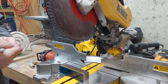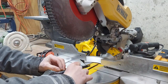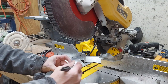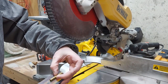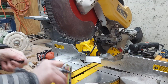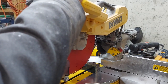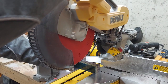For this step I'm going to use my big DeWalt chop saw because the block's so big and I think it's safer. I could also do this by hand but we'll use the chop saw. I want to mark extra meat on both ends because this will be dressed down on the disc grinder right next door — you want some room to work in case you blow out a little bit or mess up the ends. I'm going to do one cut at a time because of the kerf, and I actually sight down on my right side — I want my line to be visible on the right side beyond the blade.